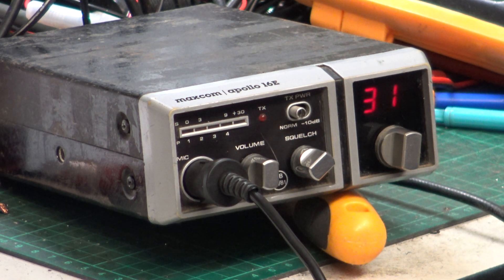Now this is a very sensitive radio. If you looked at the repair video, we managed to get — it's not so much the SINAD reading, which was I think 0.4-something for 12 dB SINAD — but we could actually hear down to less than 0.1 of a microvolt, and the squelch responded to less than 0.1 of a microvolt. So you shouldn't have any problems hearing him around Scratchy Corner.